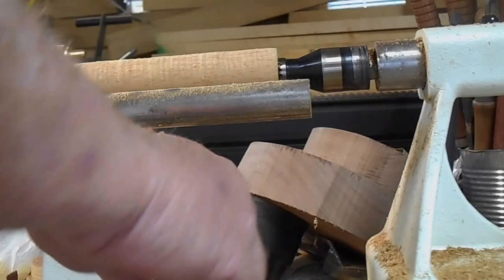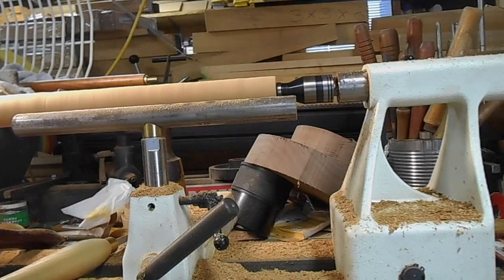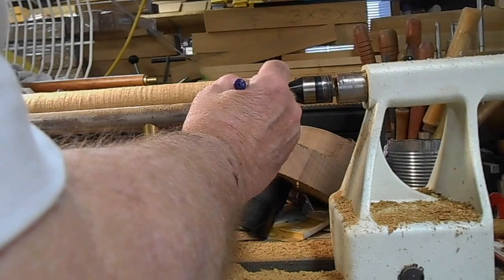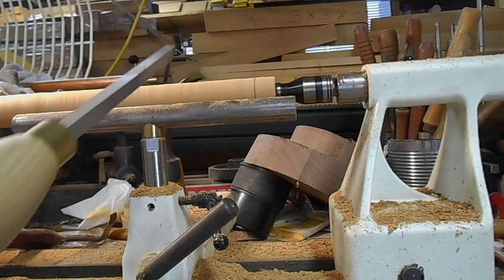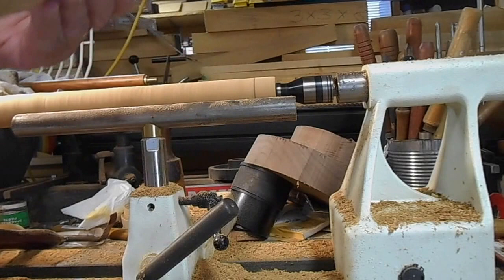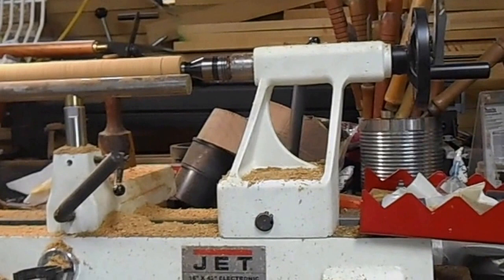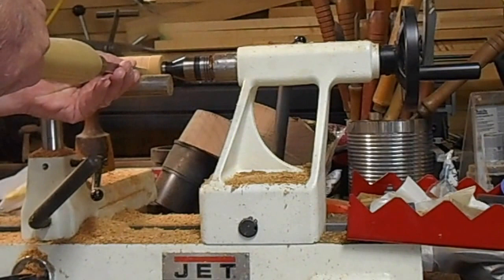Here I'm working on the bottom part of this section of the walking stick. I'm going to be cutting the taper on that end using a bedan for that. That tapers about 12.8 degrees and goes up the shaft about an inch, tapering down to the end. There's a brass piece that gets epoxied over that end, and that brass piece holds the different tips for your walking stick. I got this from Lee Valley — there's a rubber tip and a stainless steel point that you can interchange. It took several measurements to get this taper right.